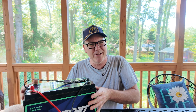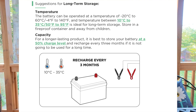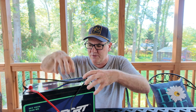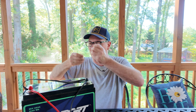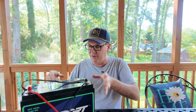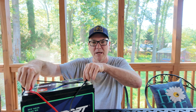I brought it into my basement so that it wouldn't be subject to freezing temperatures. You want to have these things stored where you're keeping them at about 60% charge, and you're checking them every month or couple of months and recharging them back up again. These have a battery management system in them — a BMS. This is not a regular lead acid battery. Instead, it's probably a whole bunch of little cylindrical batteries on a circuit board, wired up, sitting in a box with insulation around it and two wires coming up to the terminals.